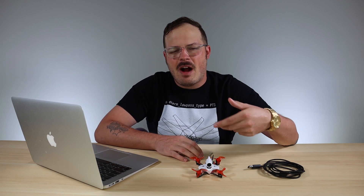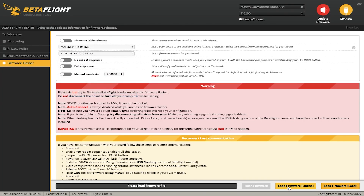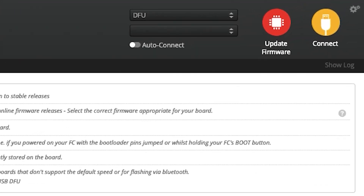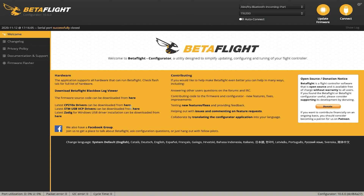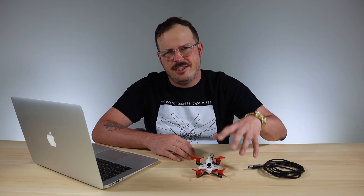You may be asking why you need to use the old school way when you can just go into Betaflight and hit the DFU command, the bootloader command, or even use the firmware flasher to automatically put it into DFU mode. But sometimes that option won't work. One of the most common issues is when you're messing with the settings, you hit 'reset all settings,' and that actually locks your board out — you won't be able to connect through the computer and you'll only see VTX lights lighting up on your Tiny Hawk.